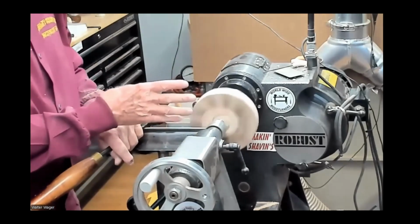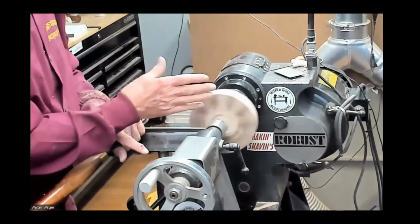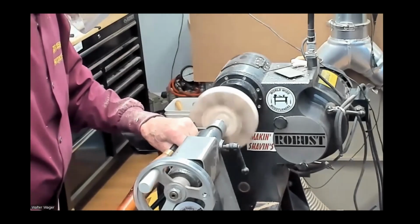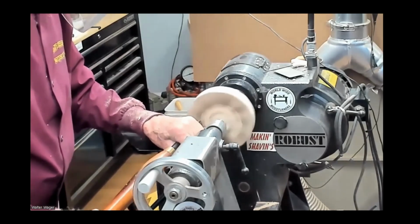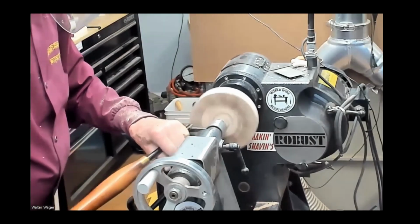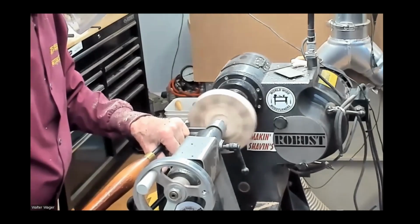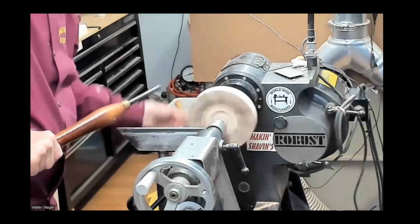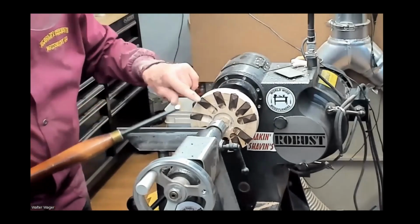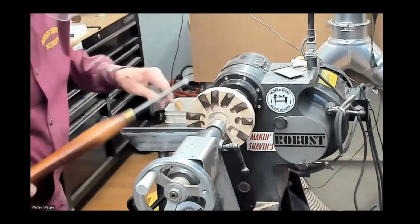These are horizontal fibers, the inlays, and I'm going to cut the ends off of them. I'm not just going to plow them, I'm going to cut the ends off of them. It just makes a little smoother cut rather than tearing into them. On the outside, I'll turn the outside this way. So now you can see what I'm doing here. I'm taking the edges off. I'm not just tearing these things apart. I've left little nipples on each one of these, and I'm taking these off this way.